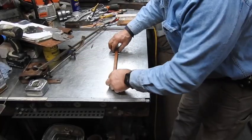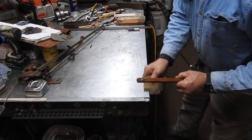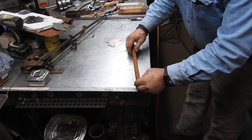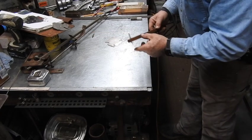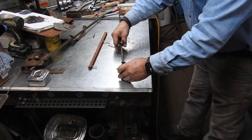You stair-step your metal all the way up, hook the outside edge right on the first piece of metal at your 1-inch scribe. You'll make a 1-inch scribe for the double hem flange down here, then take this — I like to hold it like a handle — set it right against that end, and right there on the 1-inch mark put your scribe. Then move up to the next piece of metal and make it on the 1-inch mark, and then up to the next and the next. Literally in 20 seconds you've marked 12 sheet halves with a 9-inch dimension for the notch for the 90-degree fold when making your duct halves. The longer trammel points work fine too — just a little unwieldy — you do exactly the same thing and mark right up the line. The real trick is using the drill to keep it rolling, which keeps your point centered on the material.